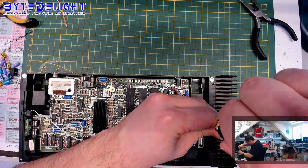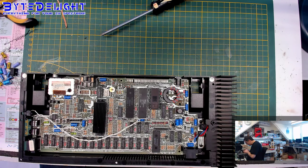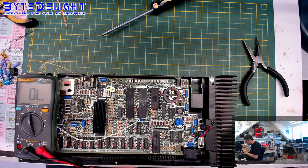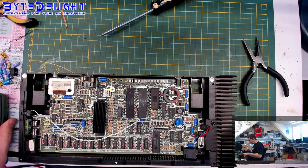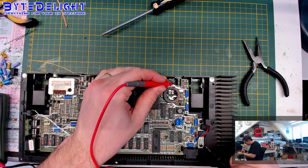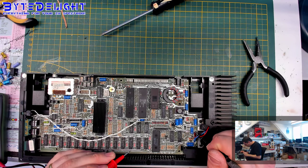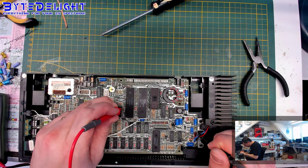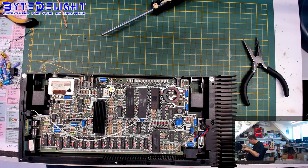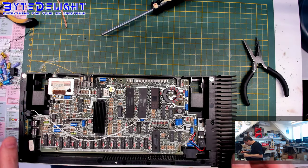So, alright. Now, before doing anything else, you have to get these pins a bit to the top, and as I said, I want to make sure that I'm using the correct orientation of the plug. So I'm just going to check. I know that the left pin of the 7805 is the input pin, so that should be connected to the positive pin on the DC input socket, which is not the center pin but the outside, as most Spectrum people know, and that should be this one. And then the 5 volt should be this one here, and which goes to, for example, this pin here. Yeah, okay, and this one here. Alright, so that's okay. There's no short between them. Alright. So the red wire is the output, the 5 volt output, and the blue wire is the 9 volt input. So it should be connected this way.